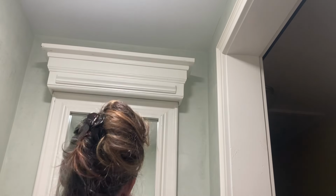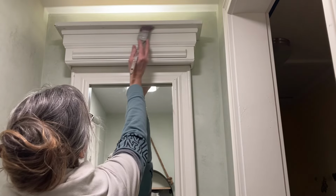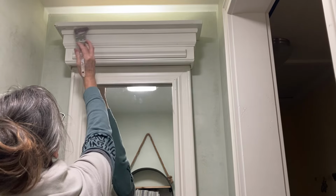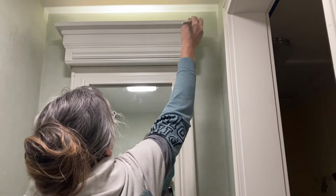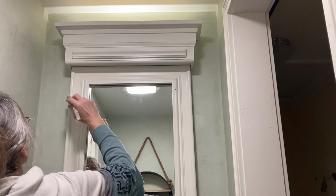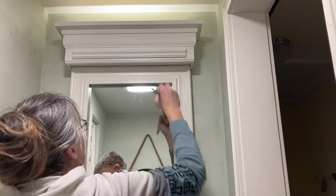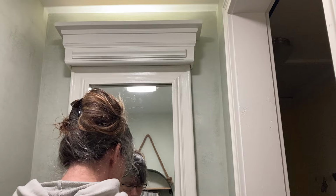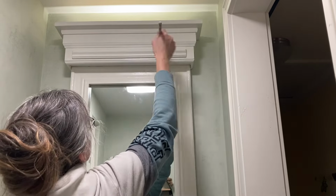And now, finally, the last thing to do is the last coats of paint. Being that this thing was on and off so many times and I've accidentally knocked it into stuff, there's some dark spots coming through the couple of layers of paint that I've already done. So I go ahead and I just touch up the darkest areas first, feathering the paint out along the way so there's no stopping points. And then after that dries, I come back and I do one final coat of paint,